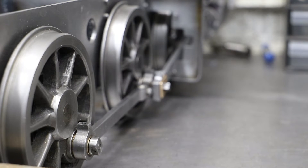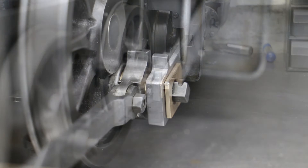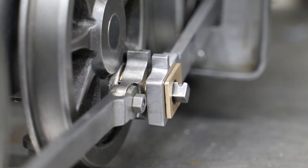Looking here from the rear of the engine, we can see the connecting rod in place, albeit without the bearing yet being secured. First off, we can see the issue with the crank pin being too short. This is expected because the con rods are 1mm further out from the frames than Don's design stipulates. The fix will be relatively simple, requiring two new and slightly longer crank pins. The bigger problem will be fitting those crank pins, because I'll need to remove the old ones, which requires heat into the wheels to break the Loctite, which almost certainly means it will break the joint between the wheels and the axles. So not only will I need to fit the new crank pins, but I'll need to re-fit the wheels and quarter them at the same time. Not difficult, but painful.